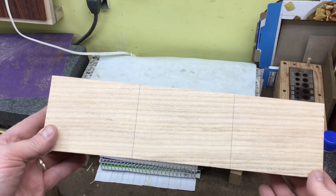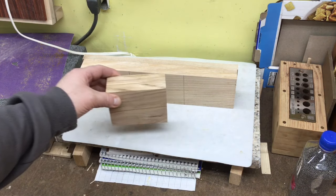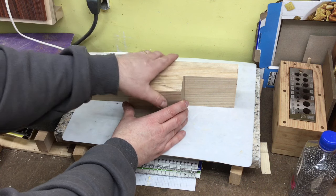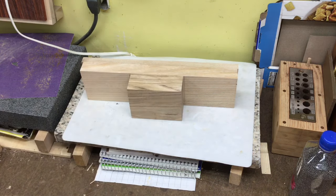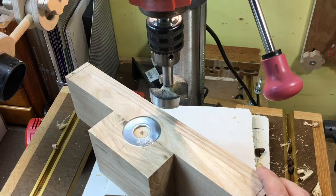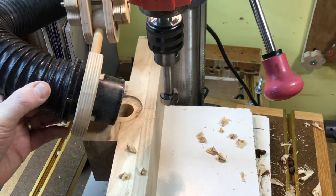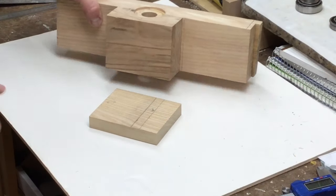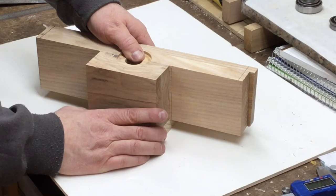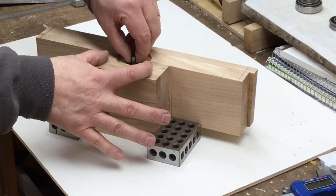The C4 beam that goes along the top of the carriage then gets the C1 block we just trimmed glued to the bottom of it, centered as you can see here. Once the glue is dry, a large washer divot is drilled right in the center of the C1-C4 block. Then the clearance hole is drilled the rest of the way through. Using the center of the clearance hole just drilled, we can find the center of the C2 plate. That center is used to make a hexagonal hole to fit a lead screw nut. We will get back to this part later.